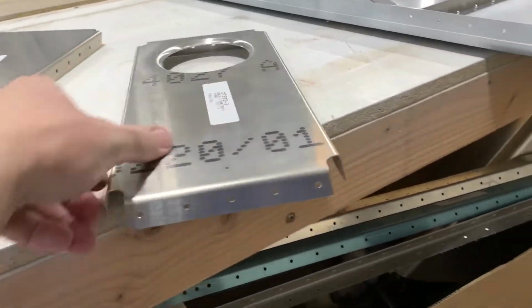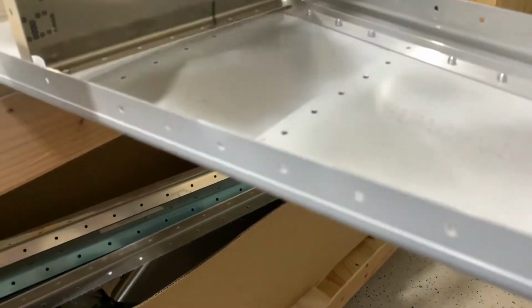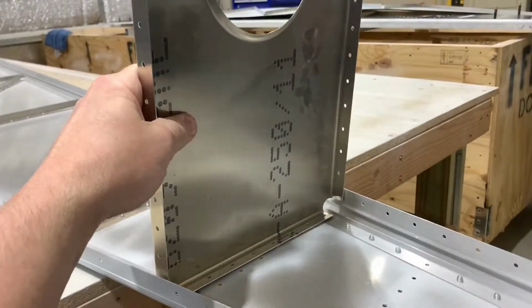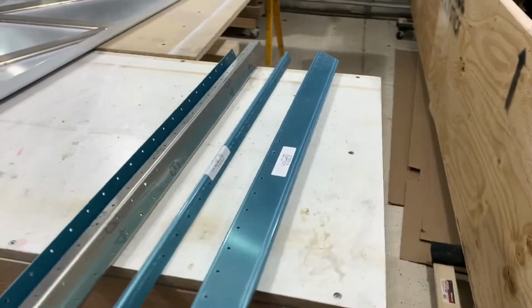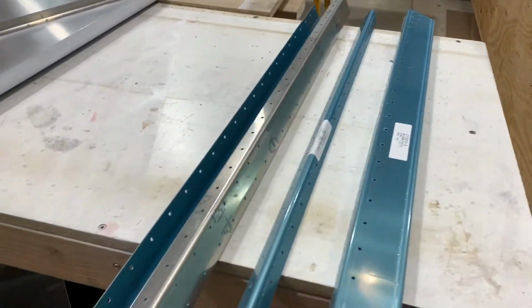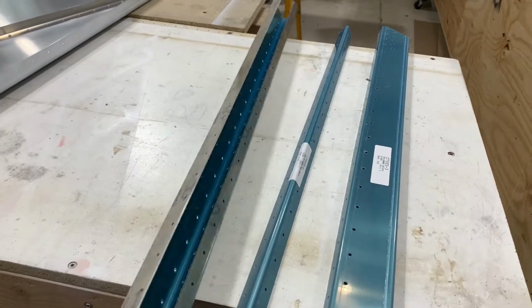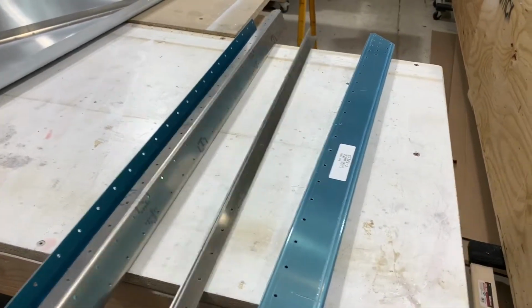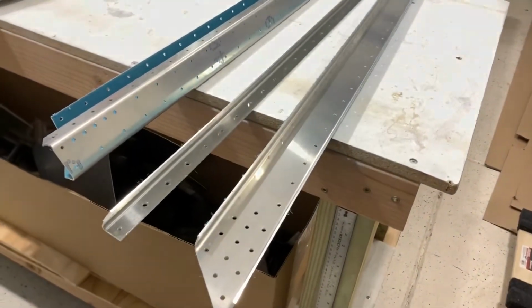There are two bulkheads in the aft part of the fuselage, and this is just showing those two bulkheads in position. Just gotta make sure the orientation is correct. These three thick pieces of aluminum together form a strong box. This box will go in the front of the aft fuselage as a top cross member. Eventually the aft wing spars will attach to this structure. I had decided it would be a good idea to make this structure first before joining my fuselage skins.